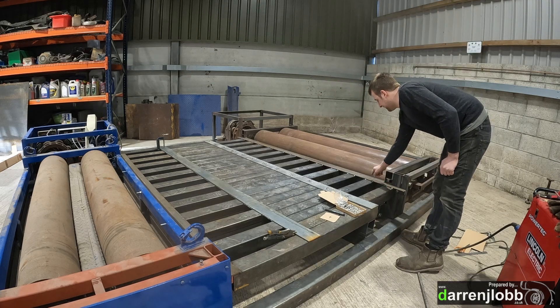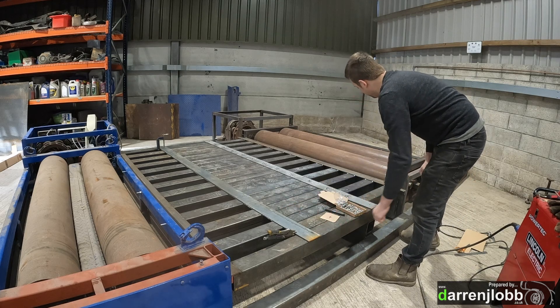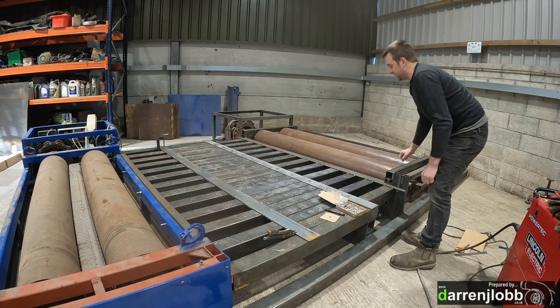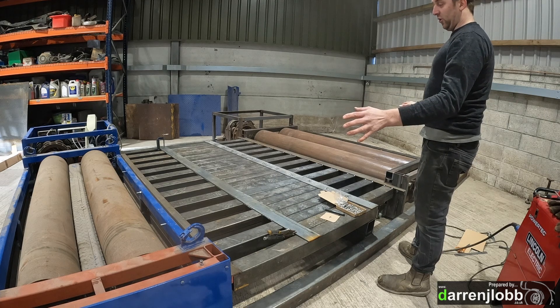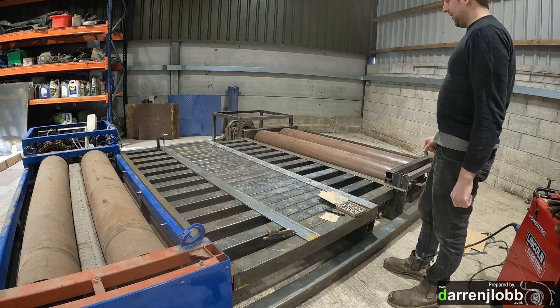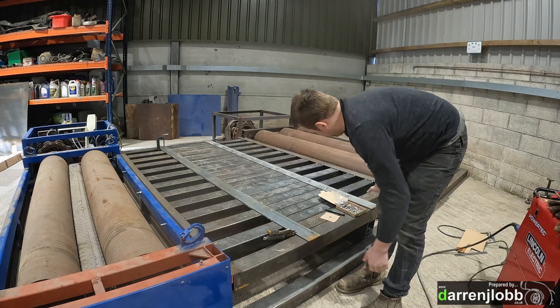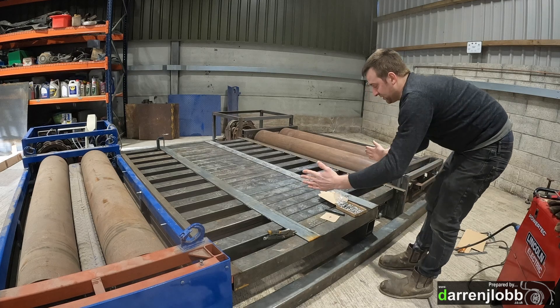The floor on this side is tack welded to the support on this dyno, not the same for this one — that piece of angle is bolted to the dyno, so the two halves of the floor can come apart and obviously be taken off if you need to get in there. I've used a 100mm flat bar to sandwich each side of the dyno, so that's obviously where they'll be sliding.